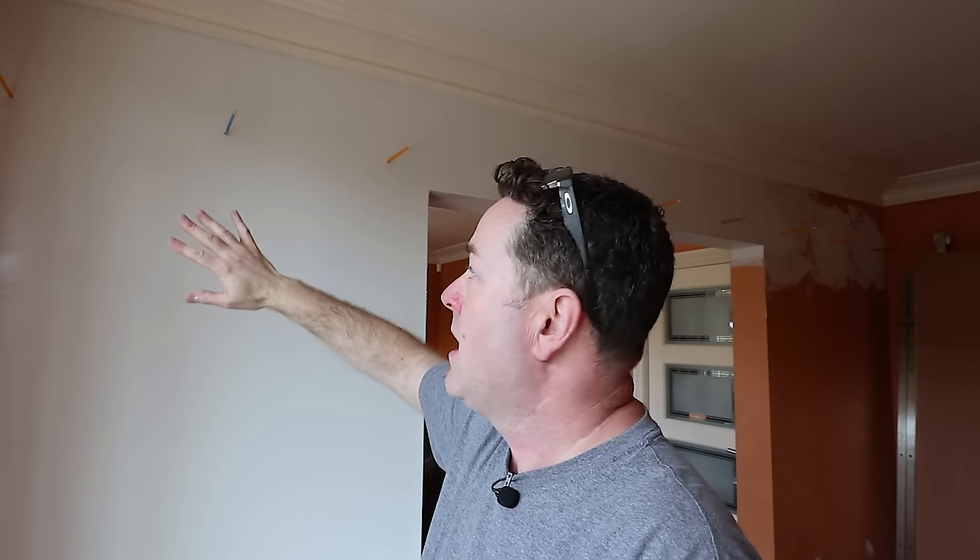There we have it. I've probably been about an hour and a half to do both sides. On this second side I've got pencils in some holes — there are four of them for the barn door brackets that slide across — just to mark where the bolts are. I've skimmed all these out now. This is the first layer — up close it looks a little uneven, but I'm not worried about that because with the second coat I'll be building up about one to two mil at a time. The second coat will let me blend those out and get a thicker coating. The main reason I want a second coat is the angle beads there — they step away from the plasterboard.